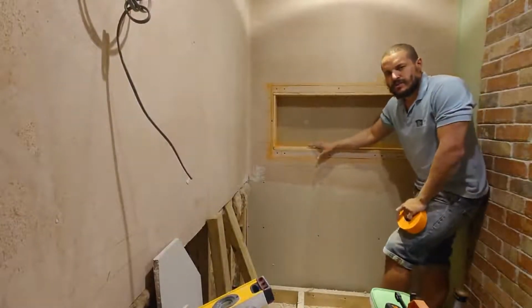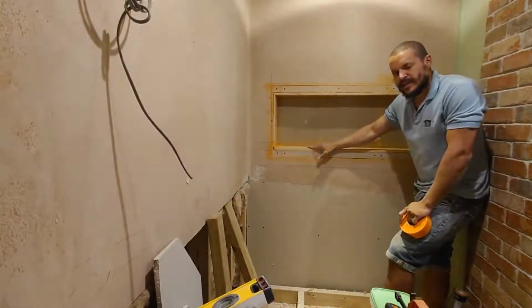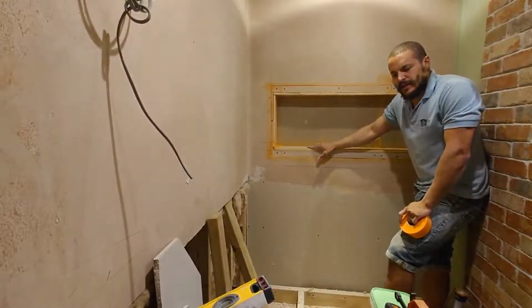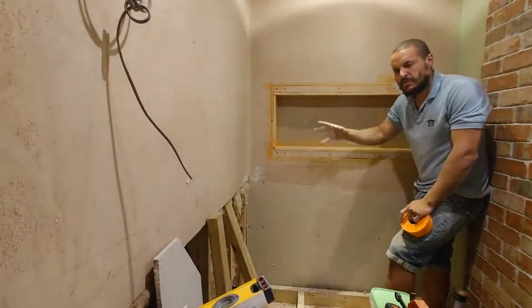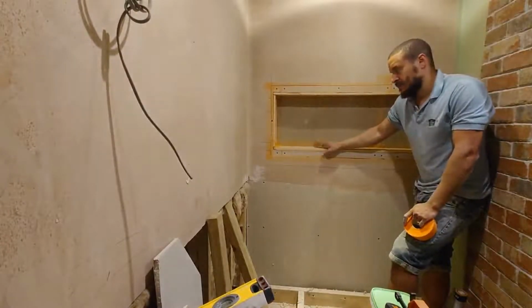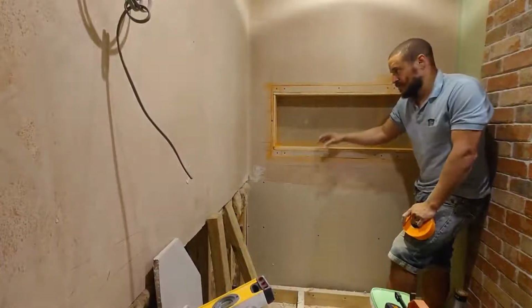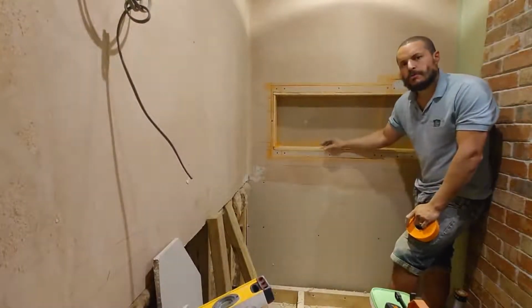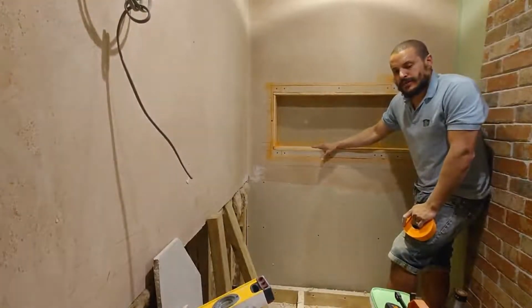It's one of the videos I watched from the DIY Renovation, which again I'll put a link in. Suggested that if you was to put the tile backer straight onto the wood, then as the wood contracts, expands, which it might do over time anyway, there's a better chance of it cracking. So instead, putting plasterboard on, which will have a little bit of flex in, will allow for that contraction and expansion, just, you know, to a micro millimetre sort of thing. So that's in.